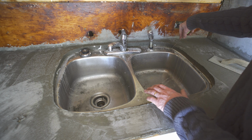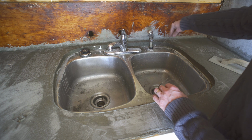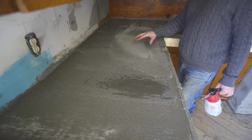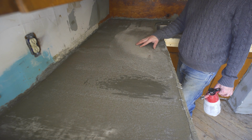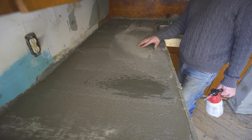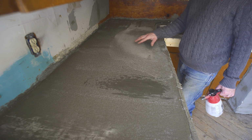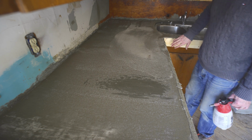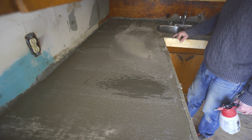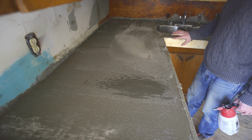And we do it at this stage because the concrete is still pretty fresh, so it's easy to break, easy to chip off around the edges. Now after 24 hours, even though the cement has set up a little bit and it's fairly firm, it's still not strong and it's still in the process of curing. So it's important that this stays moist. What I'm doing here is leaving the forms on so that the edges don't dry out. Remember, I've got the aluminum tape around the border here, so that's sealing in the moisture.